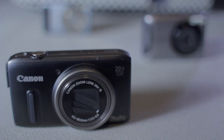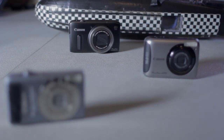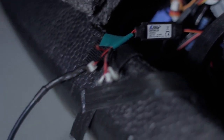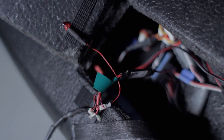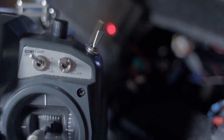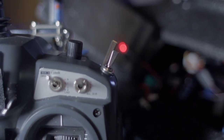It is significantly heavier than the other two cameras. To control the camera, I soldered a USB cable — just the black and red leads — to an eFlight LED controller. The eFlight LED light controller connects from the RC receiver to a modified USB cable, so when I trigger a switch on my RC transmitter, it sends the appropriate signal to the USB cable via the light controller and initiates an intervalometer script on board the camera.